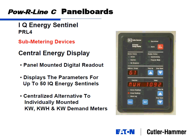We'll do, for the PTs, we'll tap directly off the bus. So we'll tap out of bus. This is all ABC. So we'll tap directly off the bus, away from contact for anybody, we'll wire out into a PT disconnect.